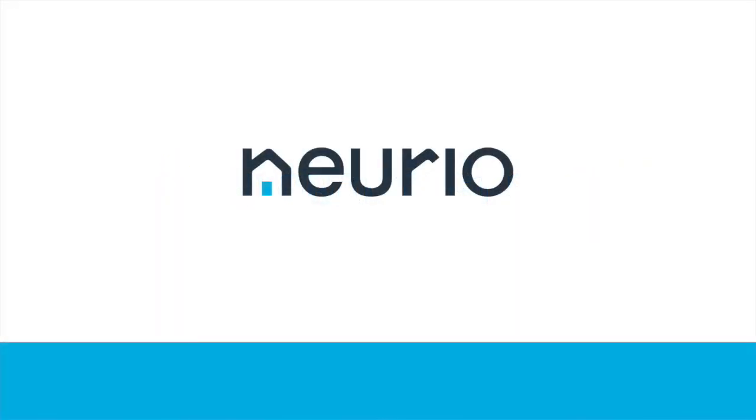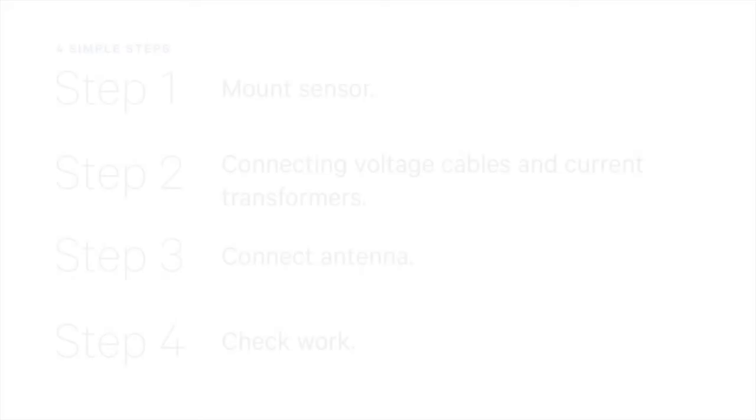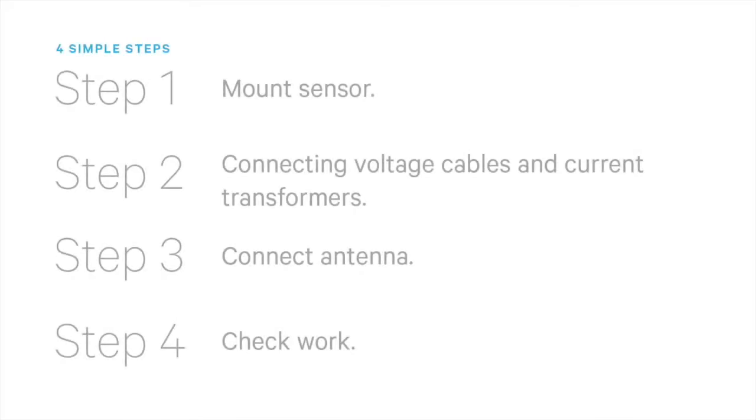Welcome to the Neurio sensor installation video. This video will show you how to install the Neurio sensor in a two-phase electrical panel. There are 4 main steps you need to follow: mounting the sensor inside the panel, connecting the voltage cables and current transformers, connecting the antenna, checking your work.